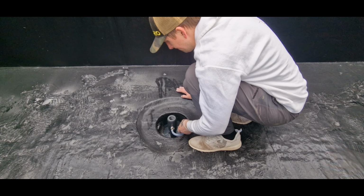So I'm just about to start swapping the Profi drum from pump fed, swapping it round to gravity. The holes are already here, just need to move the probes and the LPP switch sensor, or LLP even, low level protection. And open up the front of the switch box.